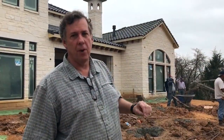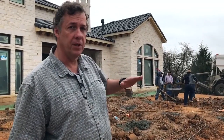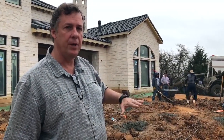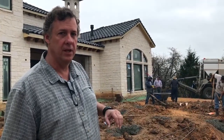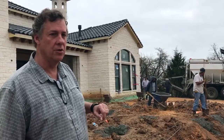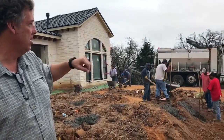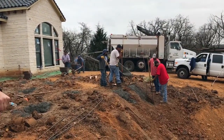To set the proper elevation, they set up a level sitting over by the truck and then measure down from that to get the top of where the pier is going to be. That'll be where the pool sits on top. When we dig the hole, all you'll see are the tops of these piers, because they're based on the measurements that they're taking.